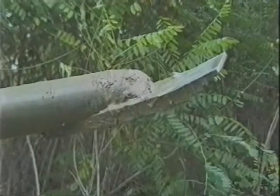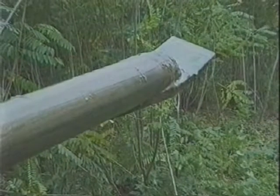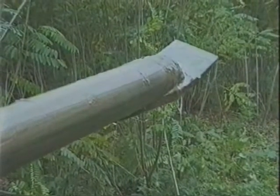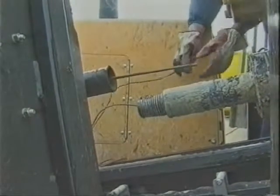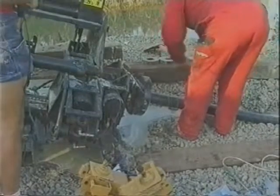Steering is controlled by a spoon-shaped drill head, which can be precision steered and eats its way through the ground in the desired direction. The transmitter is positioned at the front of the drill head and transmits a signal to the computer located on the drilling rig.